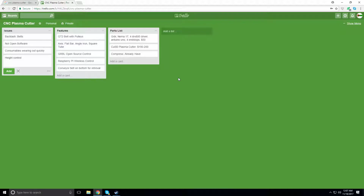What will happen is, on y0, which means it hasn't progressed at all to the left on the table, x will be 15 inches, and then on y 4 feet, x will be 20 inches. So you have a cosine error there of 5 inches. One side is 5 inches farther than the other side.